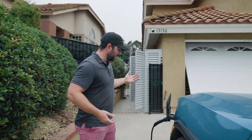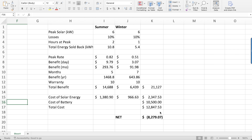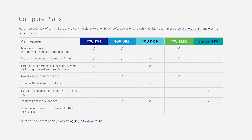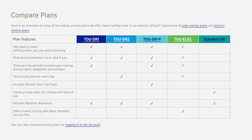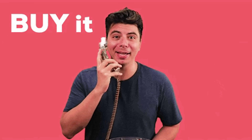Let's finish up charging and head back to do the math to see how affordable this system can be. Back home — I didn't make it to the studio — but I made it specific to my setup because there are too many variables for a generalization. I will make the spreadsheet available so you can download it, plug in your own numbers and figure it out for yourself. The way it works: with a battery like this you can go off-grid, and if you have time-of-use pricing where you're charged different rates at different times of day — which a lot of people do — you can go off-grid during peak time and sell energy back to the grid at a higher rate than what you paid for it.